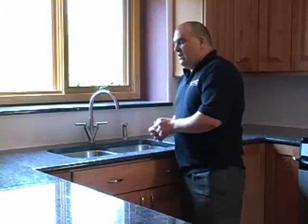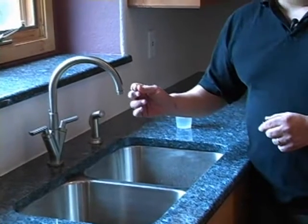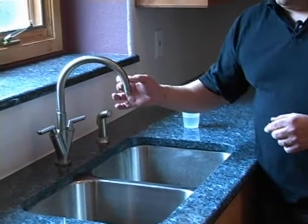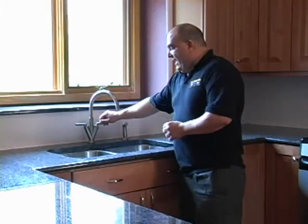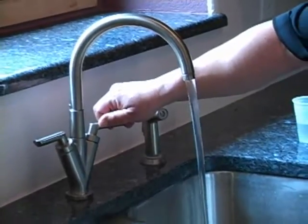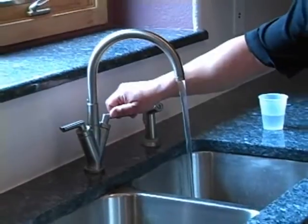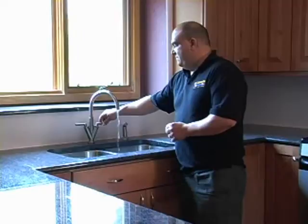Once the aerator is removed, I would take an alcohol swab or a Q-tip with alcohol on it and disinfect the faucet. Some states require the use of a flame to superheat the metal to disinfect it. After that, I would turn the water on and allow it to run until there's a noticeable change in temperature or until I have ensured that the well pump has gone on and started to fill the tank. As the water is running, I would take my container and fill it according to the lab's instructions.